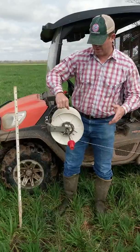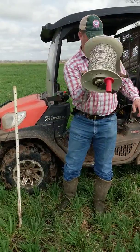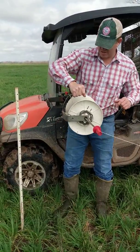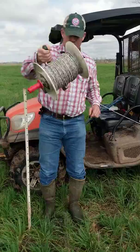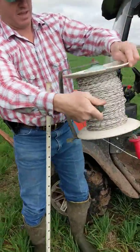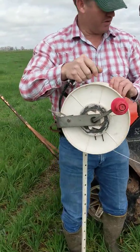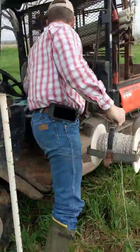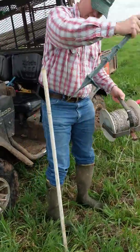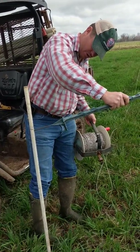Then I can take the lock off. This is where it gets tricky if you're working with a hot fence. If the fence is hot and I wanted to make the reel hot, I'll just pinch the wire around that hook and hook up whatever I was doing. There are several ways to use the reel on a fiberglass post — you can take the gap right there and kind of wedge it on. Some reels hold it tighter than others.